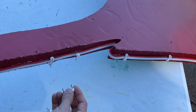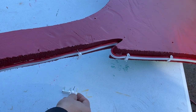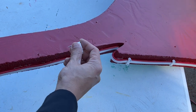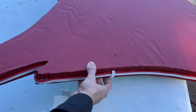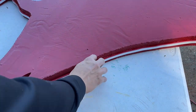The reason you remove the staples early is you don't want the glue to harden around them so you can't take them off. In about three hours it'll be tacky enough that the strip won't fall off, and the staples will still be pliable so you can pull them out. If you leave them in too long they'll stay stuck there permanently. It's super easy and super simple — let's get to it.